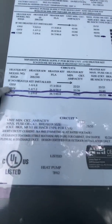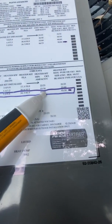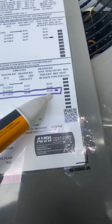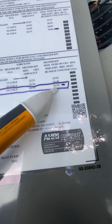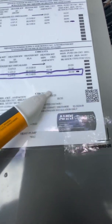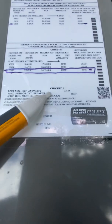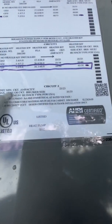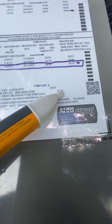If you were going to do it with two circuits, the minimum circuit ampacity is 50 and your max overcurrent is 50, so you would have one breaker feeding the unit with a 50. Then your second circuit for the air conditioning unit would have a minimum circuit ampacity of 23, and max fuse or circuit breaker size is 35.